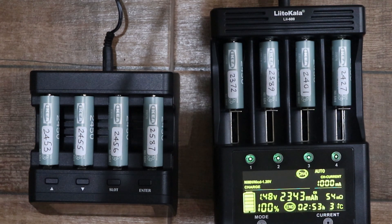When analyzing battery capacity, I understand you can't do it if there's already some charge in the battery. You can completely discharge a battery and then charge it, and the charger will tell you how much power it put into the battery. Or you can have a completely full battery, discharge it, and the charger will tell you how much power was taken out.